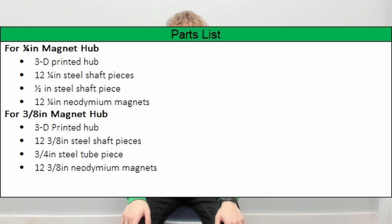We tried to improve it with some other prototypes. We made a smaller one and a bigger one. The smaller one we hoped would perform better because we reduced the plastic in the way of the magnets, and we hoped that would help because it would get the magnets closer to its target. The bigger one just had a lot bigger magnets, so it would theoretically have more force behind it. Neither of those really performed much better — they still were just not powerful enough to pick up these blocks. For anyone who's interested, here's a parts list provided by one of our team members.